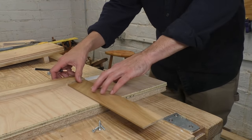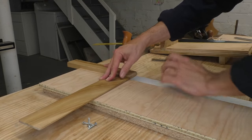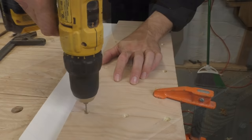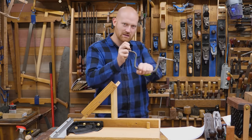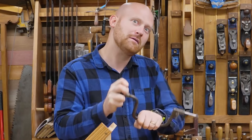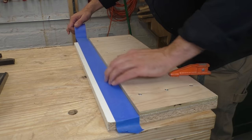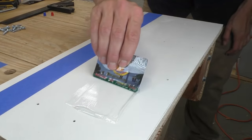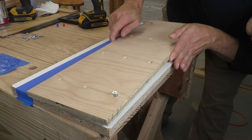Laminating the parts together can take a lot of clamps, but an easy workaround is to use screws together with glue to make a strong bond without any clamping. I'm using my big wooden try square to lay out the locations. To drill the screws, I bore the countersink first, which keeps the bit on track and gives me a smooth hole. Then I can drill through both boards and pre-thread my screws. Wood glue won't stick to low-friction melamine, so we're going to use epoxy and a bit of blue tape to keep the adhesive off the plane track. You'll need to rough up the surface with a bit of sandpaper. Mix up a generous blob of 5-minute epoxy and lay it down evenly with an old credit card. Since everything is already pre-drilled, you can use two screws to align your pieces. There's no messing around while you've got the clock ticking with quick-set adhesive.